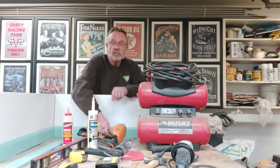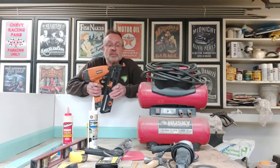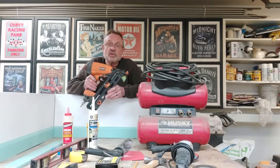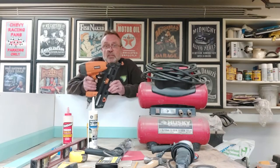In this video we're going to discuss the tools you need to install trim. The first thing to decide is: are we using an air nailer or a hammer and nails? I highly recommend you spend the money and buy an air nailer. I prefer the pneumatic — I don't much care for the cartridge nailers. They're handy and you don't have to drag a hose around, but there's an ongoing expense for cartridges that I avoid by staying a little old school with a pneumatic nailer.